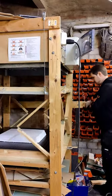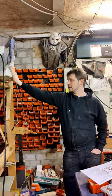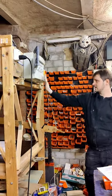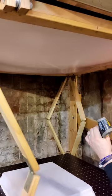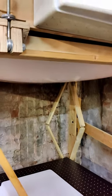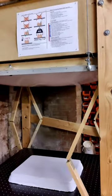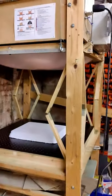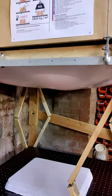We can lift the frame up to the heating position. Now the sheet is heating up and we want to reach about 160 degrees Celsius, which will take about three, maybe four minutes when it's the first time and the oven is cold. I mainly orient myself by how much the sheet has sagged already, and it's nearly ready, so let's move it down.